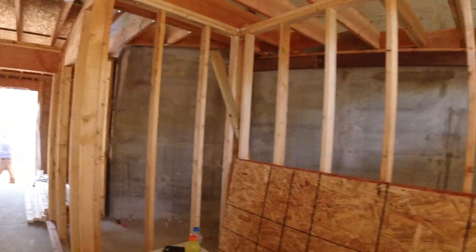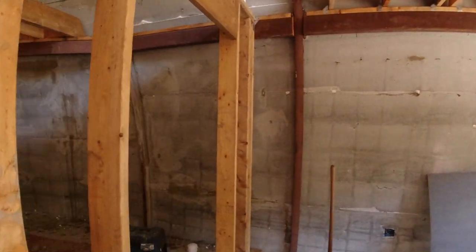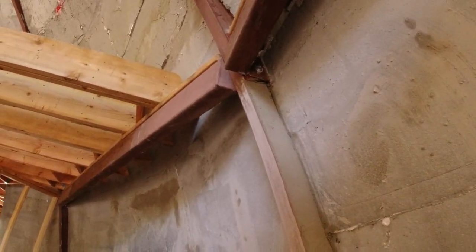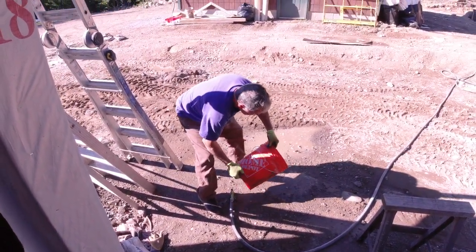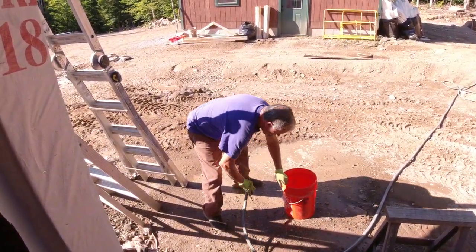Alright, Richie's cleaning up. It took four more buckets to fill the rest of this beam. So this side is done with the rapid set mortar, and this side is done too. We just have to let that really dry. We did some spots on the wall as well. The quick wall stuff is a lot more expensive, so if there's any big holes, we're using the cheaper stuff to fill it. I even did a nice line inside all the bedroom beams. This crap sticks to everything except the wall — it doesn't like to stick to the wall in a lot of spots, especially where there's part of the plastic from the foam or the foam spots. It will not stick to any of that. So we're hoping the quick wall will stick — apparently that's supposed to be better.